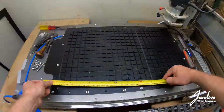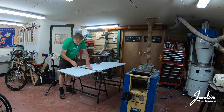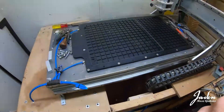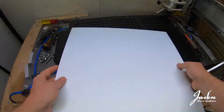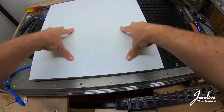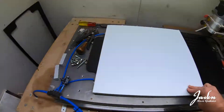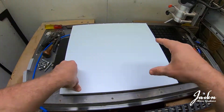So 470 square — all we have is our piece that I'm going to mount onto here, and this will be our vacuum bed basically. Once this is all cut out and sealed with some foam, we'll be able to mount the chessboard here and do all of the operations on the chessboard at the same time.